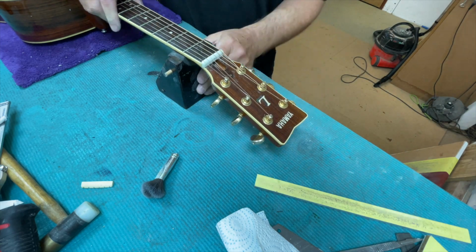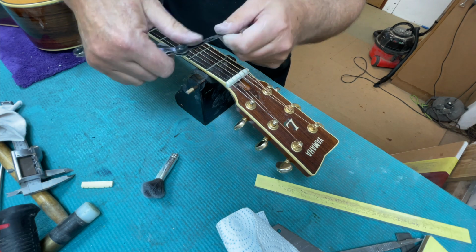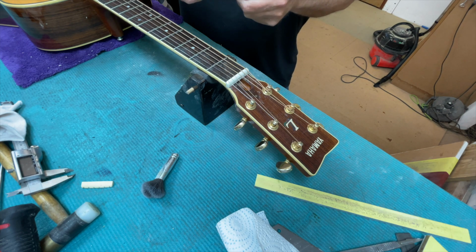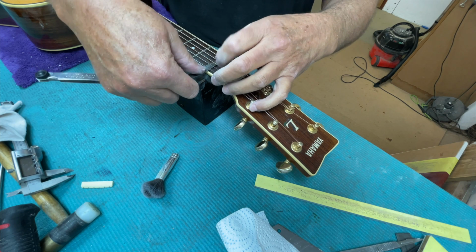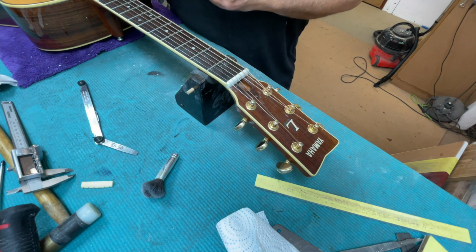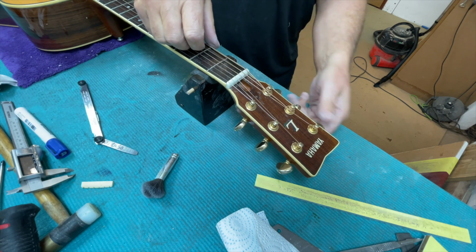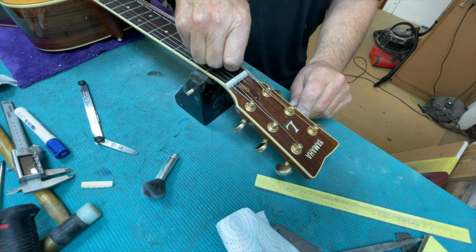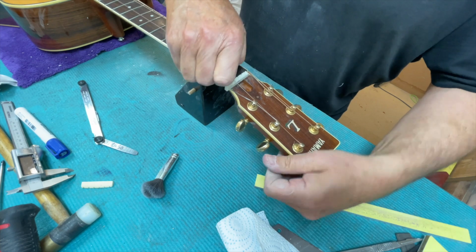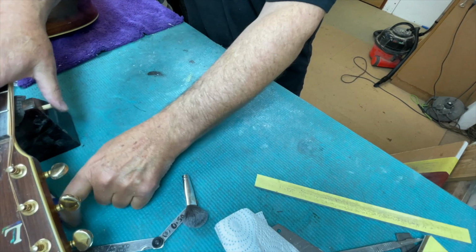We've fitted nicely. Okay, so just a quick guess, the middle ones are probably now about 0.4, maybe 0.5 even, a bit too high. Let's just measure what it is. We'll have to go from there and then pick up on the other ones, what needs deepening. Okay, I'm going to call that 0.9. So 0.9 is the gap. That's 0.6 too high in the middle. So we need to work this down a bit more.